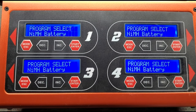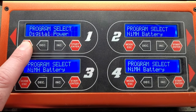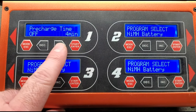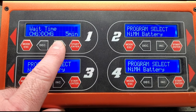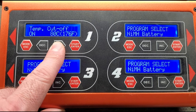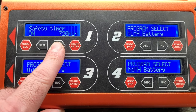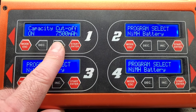The charger will maintain the settings you used last, so I should be able to show you the settings I used. Let's first do the user settings — we change through that by going to mode until we get to user settings and hit enter. Pre-charge time is turned off. Our wait time between charge and discharge is set at five minutes. Our sensitivity delta peak is set at default. Temperature cutoff is turned on at 80 degrees Celsius or 176 degrees Fahrenheit. The safety timer is turned on at 720 minutes. The capacity cutoff is turned on at 7,500 milliamps.